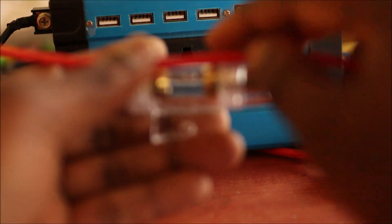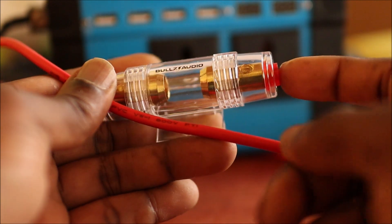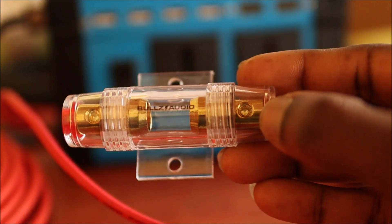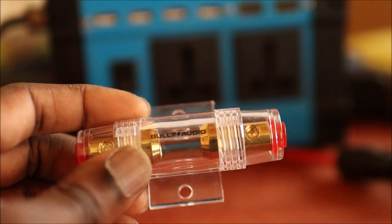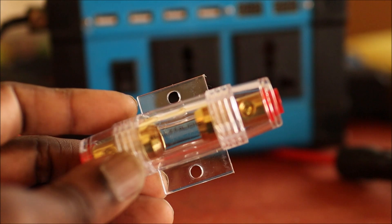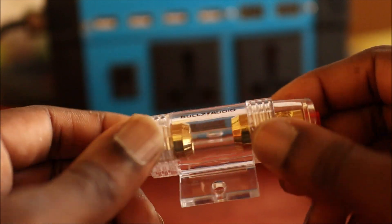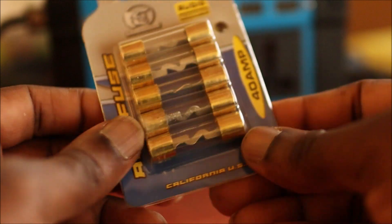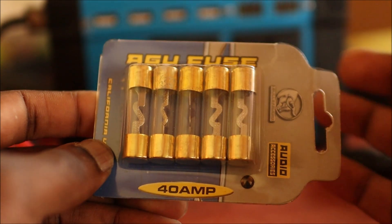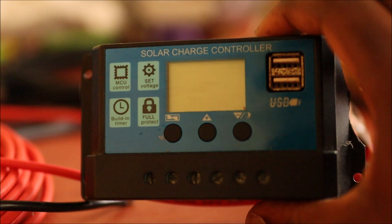For the inverter, you will cut the wire, connect the wire to one side, then connect the other side. We have screw inputs on the inside to bolt the wire down. You put the fuse in the middle — that's how you can have a fully protective solar system setup. You'll need to check your application to know what fuse rating is required: 10, 20, or 40 amps.